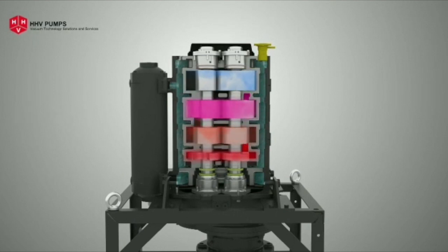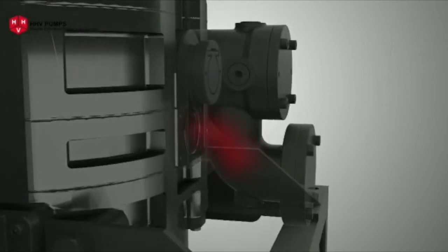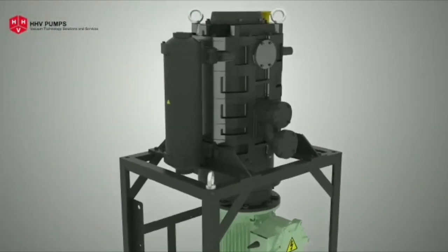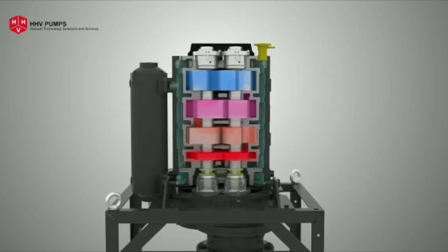Forced and continuous evacuation from the connected unit — DP 400 TS generates a vacuum of 0.05 millibar at the inlet. A pressure relief valve is available at the third stage and is set to open at an inlet pressure of 300 millibar and above.